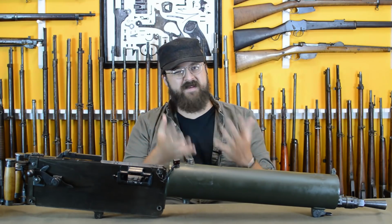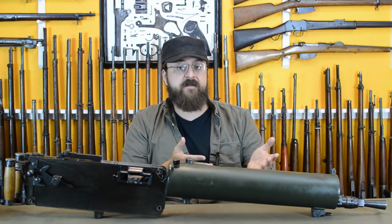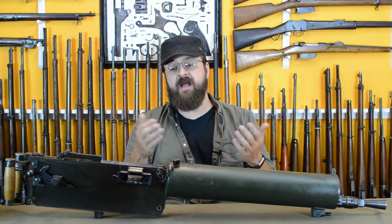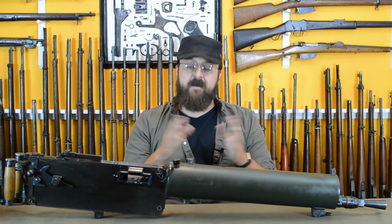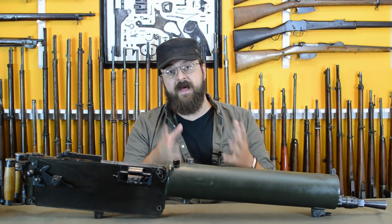But it's not good. Well, the good thing about Maxim's device is, since the cartridge has to go bang in order to cycle the action, well, then you just get a skip in the fire rate. Like, you click and there's a hesitation, hang fire, and then boom, and then you don't have any out of battery problems. And if the cartridge is bad, you just manually cycle the action and you're back in business. Yeah. There's other problems with ammunition at this time, which is that he's still dealing with black powder, and yet he's firing it very rapidly.